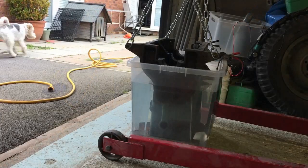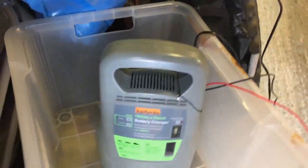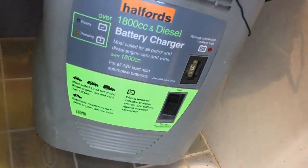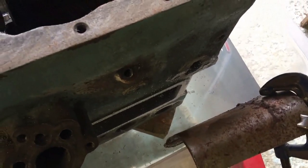Okay, so I've now filled it with water - about three inches from the top as you can see. I've put the salt in as you saw. I've now got the connections done for the battery charger - here's the battery charger, just an ordinary Halfords battery charger. I've got it on normal, not on fast - don't want to overdo it, it'll destroy the battery charger. I've got the positive on the anode, which is just a piece of steel clamped to the side of the box - I don't want it to touch. And I've got the negative on a bolt on the block. So let's switch it on.